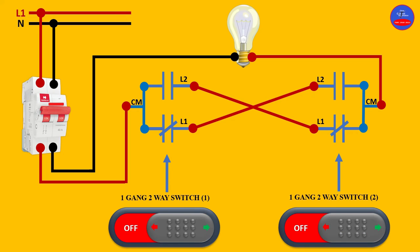When I press switch two, the contacts change their states. Line two which was closed is now open, so when current flows through, it cannot continue because this contact is open. And the other contact is also open, so no current can flow through either path — the bulb goes off. So I turned on the bulb using switch one and turned off the bulb using switch two. Now I'm going to turn on the bulb again by returning switch one to the off state.